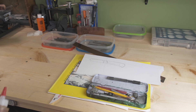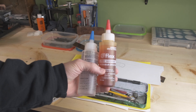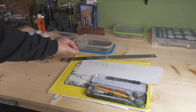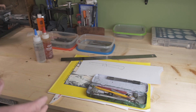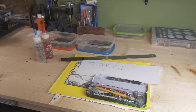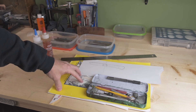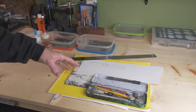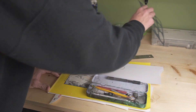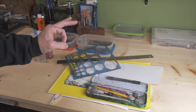Lastly, let's talk about epoxy and design. Epoxy is super important — you gotta have it; it's how you glue everything together. And design: not everybody's a designer or an artist, but a good simple drawing setup is very handy in the conception of knives. I prefer Bristol paper — smooth or vellum — you can draw really good patterns on it, they last a long time, and they're sturdier than regular paper. Draw everything to size. Get yourself a good ruler, some compasses and protractor-type things, some good pencils and erasers, and you're ready to design knives.